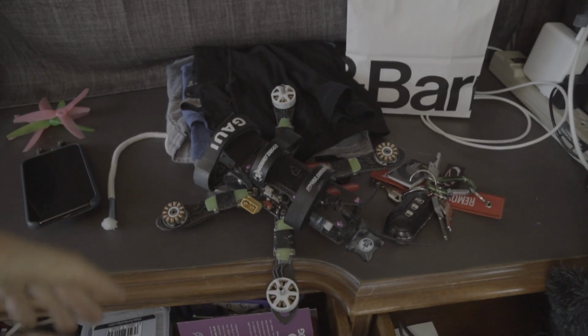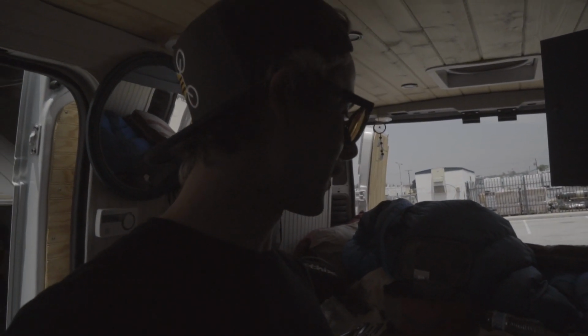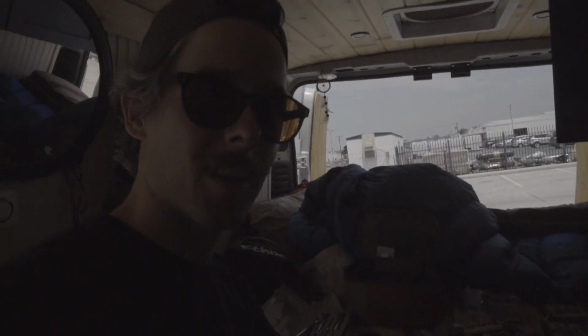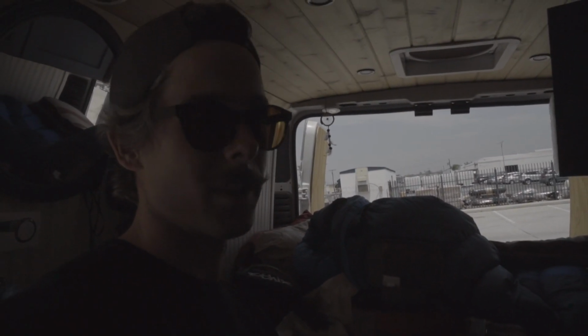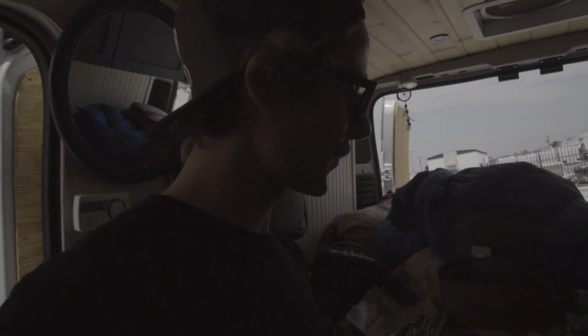But yeah, I ended up scrapping that video and making a new one because I wanted to talk to you about it. So again, I have four brand new quads here. This is the only one that's old, that's my favorite, and I'm trying to make things work again. And it's been frustrating me because I've had this quad that's been super buttery, and I've not wanted to fly the new quads because the new quads just had vibration problems, and I think I figured out why. It's because the motors are inconsistently noisy, especially with the pre-production model motors. So I'm gonna go ahead and just swap out all new motors on there.